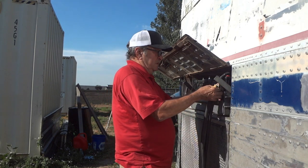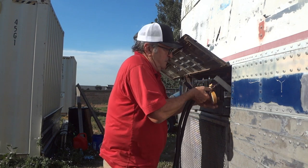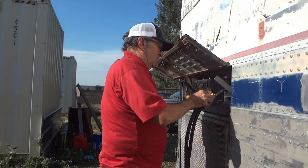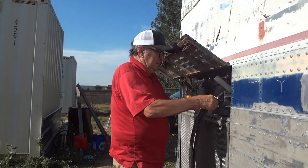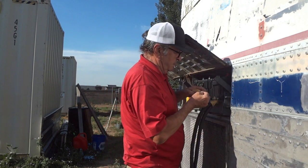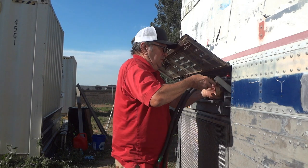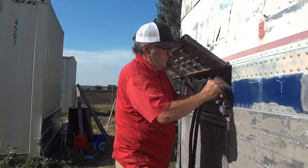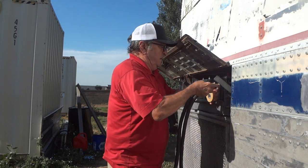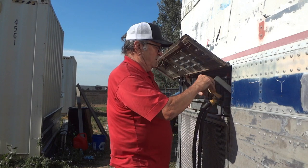You may want to deal with this later. If you've got rubber stuck to it, you are in for a real nasty tear-down to get to the splice. That rubber just sticks to the copper. So just keep in mind that the varnished cambric tape is to keep the raw rubber from sticking to your joints.